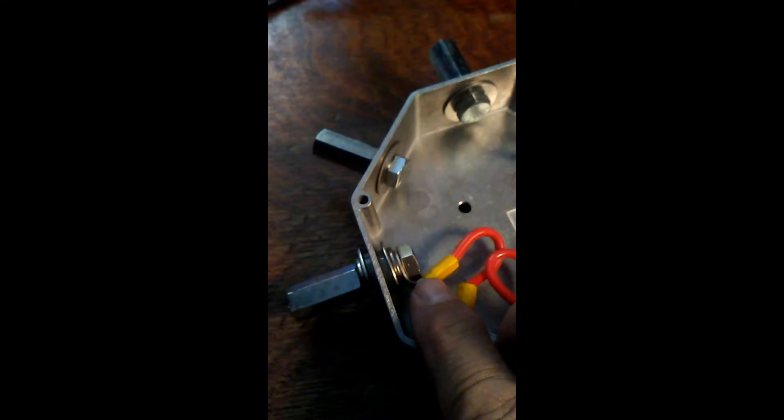Now we're going to talk about the driven side of the box. The driven side is where you have to insulate the connector from the box itself, because the box represents ground and you don't want your driven elements — where you're putting power through, where the inside lead of the coax goes — to short to ground. The other four connectors are where the shield goes. You will have to drill a slightly larger hole. Let's take a look at the components involved in building this.